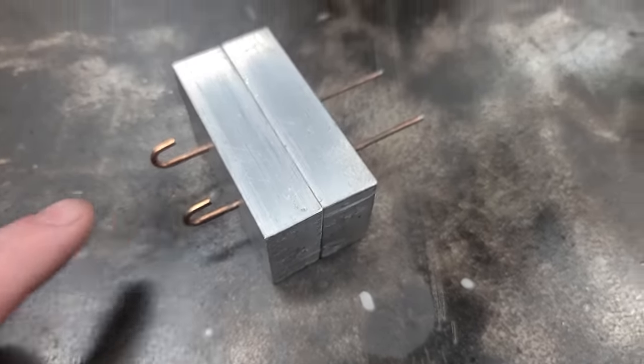Okay, so we got our pour holes drilled, and it's kind of like our example. It had a wide pour hole. You want it wider so you can hit it easier, but it kind of necks down as it goes in. You can see what I'm talking about right here. It necks down until it gets to the sinker. And the reason I wanted this part smaller is so I could clip it off.